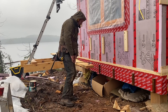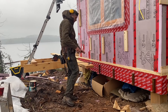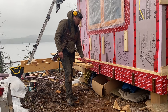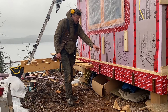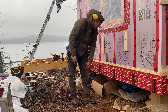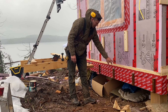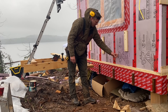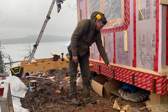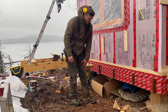Good morning — I'm back at it, trying to take the porch around the south side of the cabin. I'm cutting my two-by-eight rim joist that's going to go against these blocks. I've got one-inch spacer blocks, then backing blocks behind that go through the insulation — we've got three inches of foam here. I wouldn't want to just screw through foam and try to hang a rim joist on that, so I've got three-inch blocks screwed through into the floor framing.